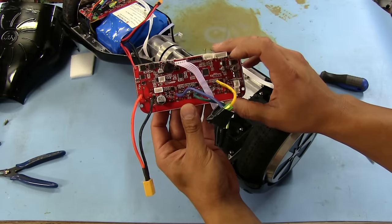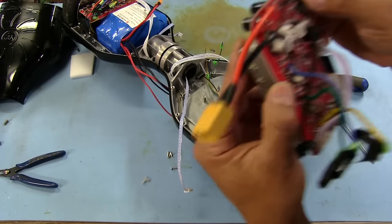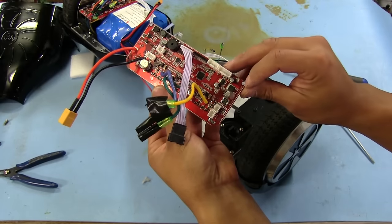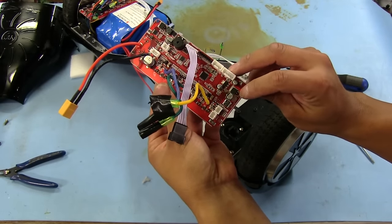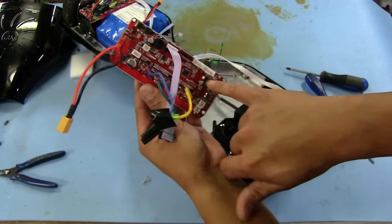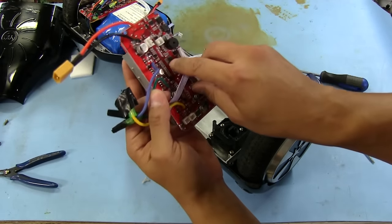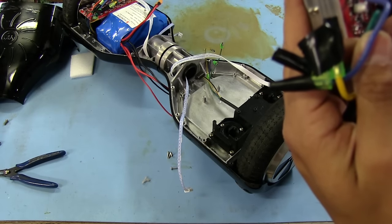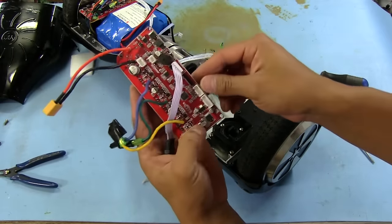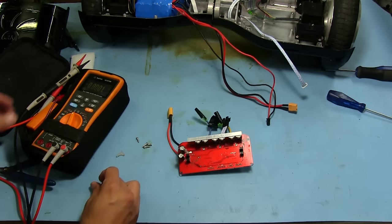That's going to be the main microcontroller. Like I said, that's going to be the accelerometer. I can't see that number, I'd have to look at it up close. That's a 5-volt regulator right there, a 7805, and that looks like it might be a 3.3-volt regulator right there, a little tiny one. A bunch of passive stuff, so that's probably an EEPROM, I'm guessing. Oh no, that's just another LM358. Now we've got the little buzzer right there. So let's poke around.